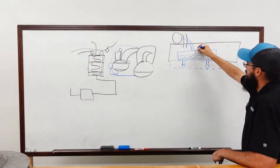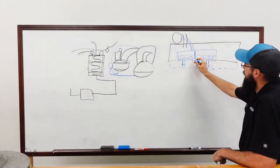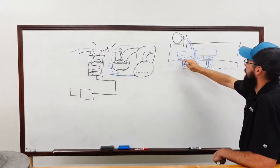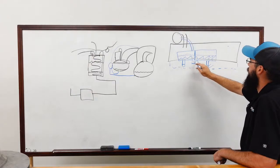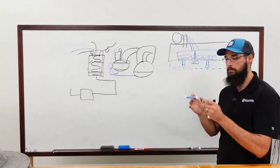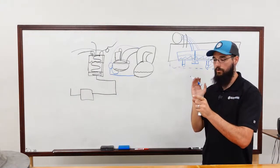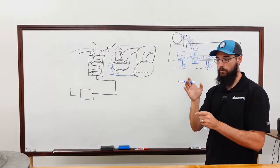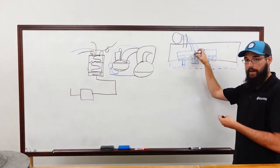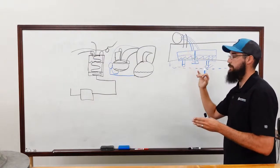It's very similar design. The difference is we have a divider plate in the middle of the economizer. In that divider plate, there's a little chamber down here at the bottom. And in that chamber, there is another orifice right here. So the refrigerant comes over, feeds down, goes through another orifice and flashes again. And then there is a second economizer line coming in. And so in between the stages of the compressor, you're hitting an economizer line in between each. Essentially between first and second stage impeller is where the second phase of the economizer feeds into. And in between second and third stage impeller is where the first stage of the economizer feeds into.